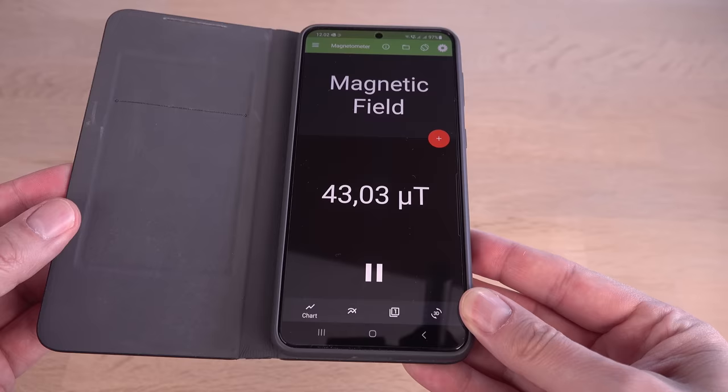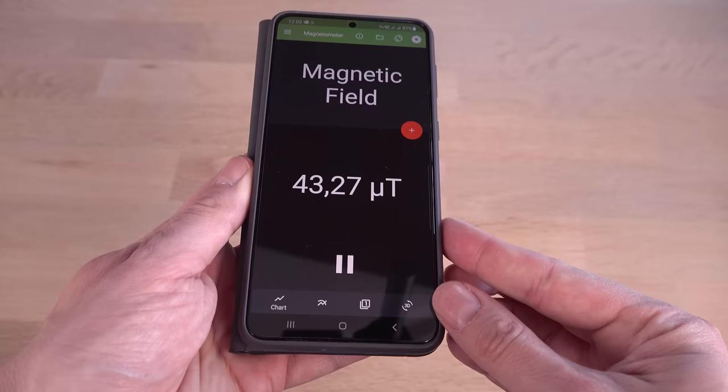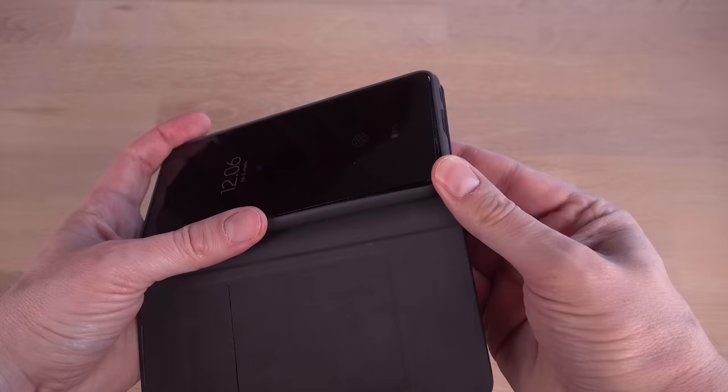Beautiful. The ring impression on the magnetic viewing film from a disc magnet reminds me of a solar eclipse. I think it is a potted, shielded magnet, which is impressive inside a cover thinner than 3 mm. Still, it looks like the magnet can offset the phone sensor by around 3 microtesla. Okay, 3 microtesla is nothing, but for max precision, I am removing the cover and its magnet.